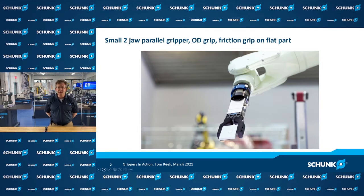The first concept is something called OD gripping. That applies as gripping on the outer edges of a workpiece. This is illustrated here using a two-jaw gripper on a robot gripping on the outer edges of the surfaces of the part.